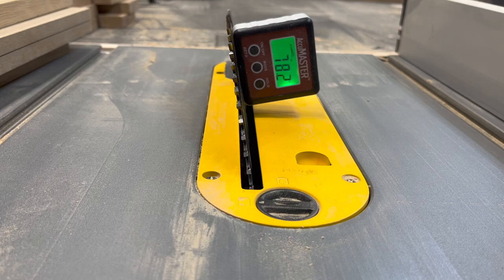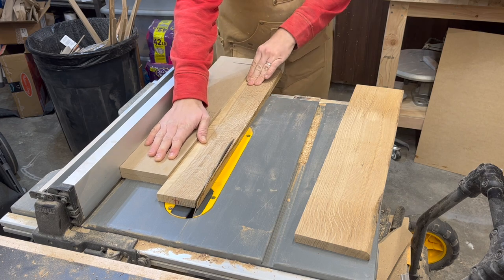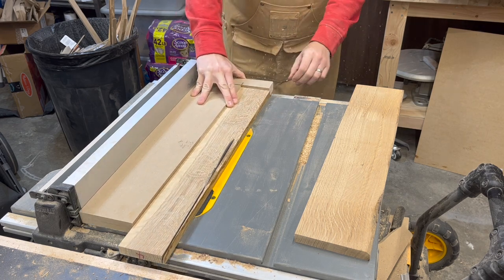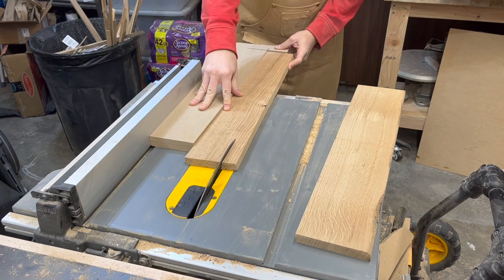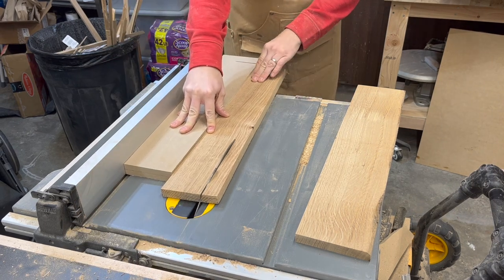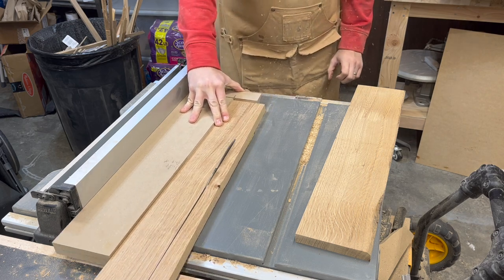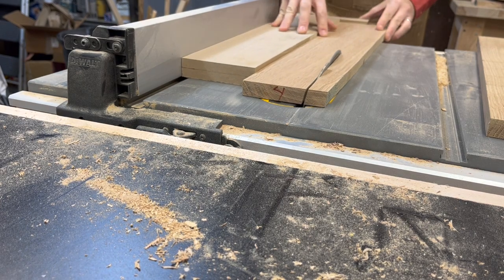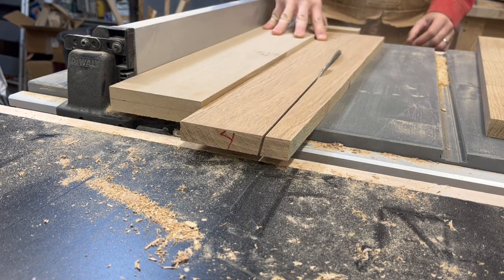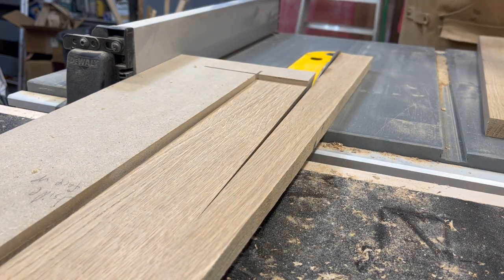It's very important to be incredibly accurate here, so that's why I'm using the digital reader for the table saw and I made sure my miter cuts were as close to accurate as they could be. This first jig has a slight taper in it created by the miter cut that I made on the miter saw, and this jig is specifically for one side of each board. As the jig works through the table saw it creates the bevel but it also slightly narrows the board, and it's really simple to just run each of the boards through it repeatedly.